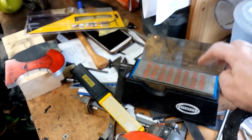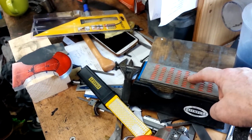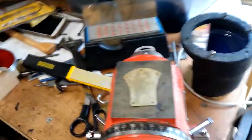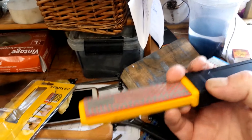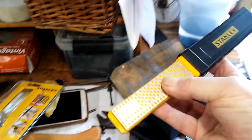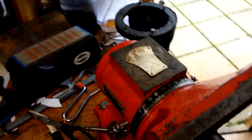Unfortunately, the chisel sharpener is a bit bendy — it flexes when you put pressure on it. The danger is that you'd end up with a curved surface, which would be no good from a steam-tightness point of view. So I went out and bought this one instead. It's got two different grits on it and it's much more rigid — not moving at all. So it should be good for smoothing this out. It'll take a bit of work to get all the scratches out and it'll end up very thin, but I think that'll be okay.